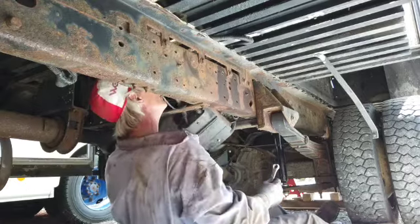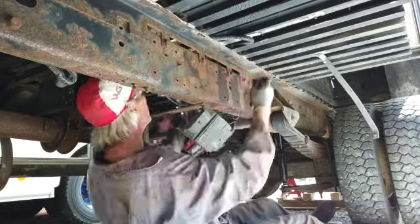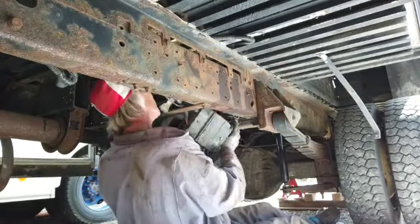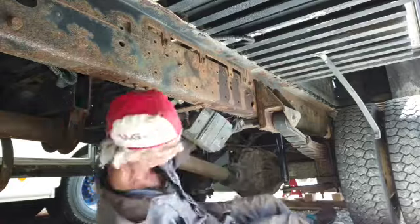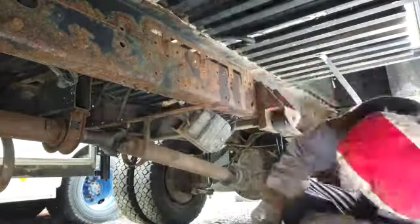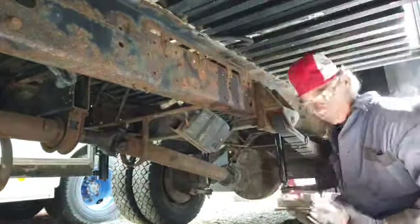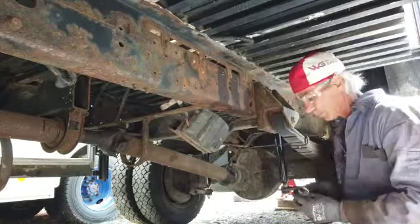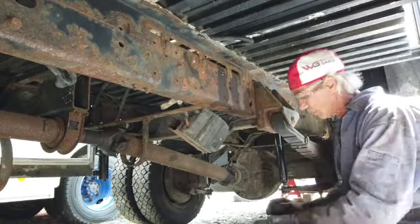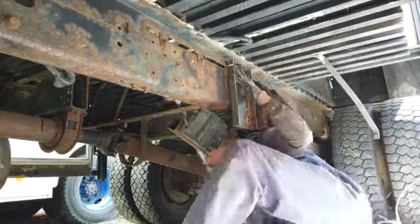That is the ABS brain. That's what controls your ABS brakes. So I have to deal with that as part of this installation on the last jack. Like I say, every jack gets a little more complicated, because I started on the first one, which was the easiest place. So I had to pop the bracket off. I have to put the ABS brake brain back on before I can put my jacks on. So I'm setting it all up so I can do that.